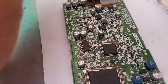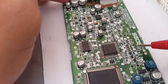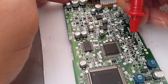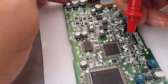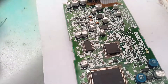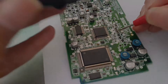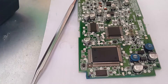Putting the black probe to ground — this is for C47 — this is good, this is good, this is good. This is the short one. The capacitor is short. I'm going to pull this out. I've already pulled out C50.